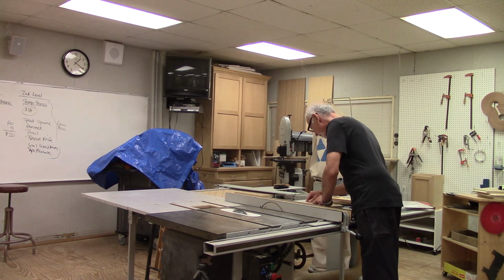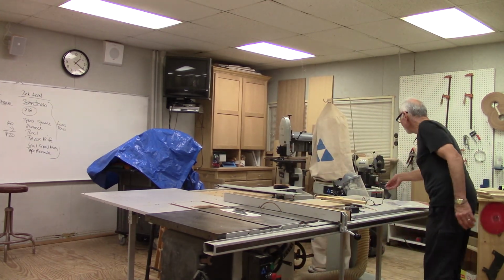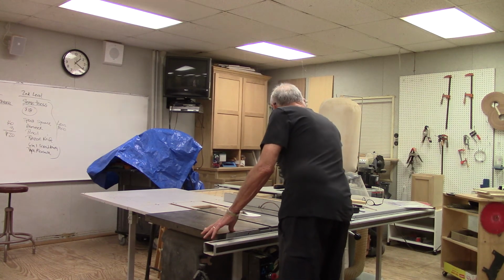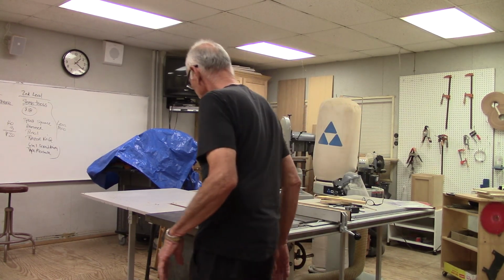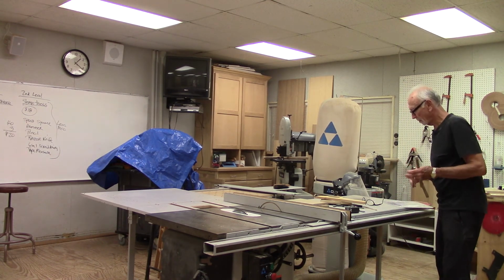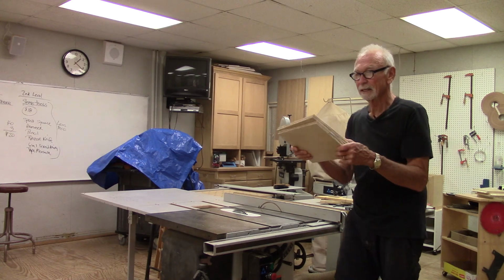10 3/4, right? Okay, and in terms of width, they're already both 9 1/2. So 10 3/4, dialed in on the Biesmeyer, turned on. Turn on the dust collection. Here we go. Okay, so we ripped these parts off. These were the joint parts, the ends of those pieces of plywood. Now we got clean plywood. Clean plywood, right? No joints.